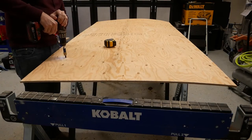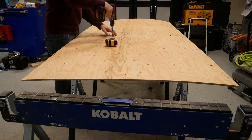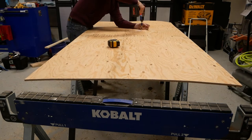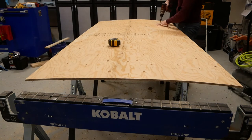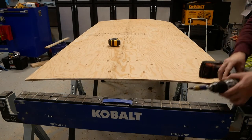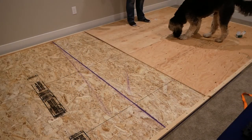On top of the just placed 3/4 inch boards, I'm going to place another layer of 3/8 ply. This will be set perpendicular to the base and should help, or hopefully eliminate, any flexing at the joints. While in the garage, I'll cut down and pre-drill. Back upstairs, and I've got some very interested four-legged helpers.